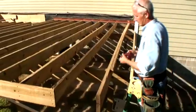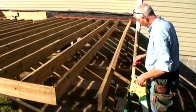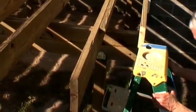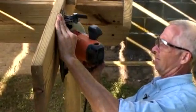Now I'm ready to cut a 45-degree corner off the end of the deck. All I have to do is draw a line across these two inside points and snap it on the intermediate joist. Draw the line down, then cut the joist with the saw set at a 45-degree bevel. Then put the band joist in place to complete the corner.